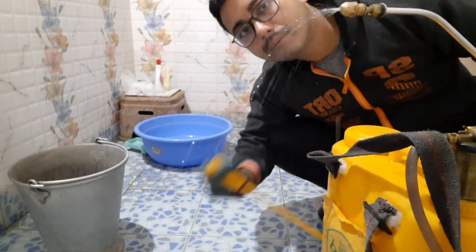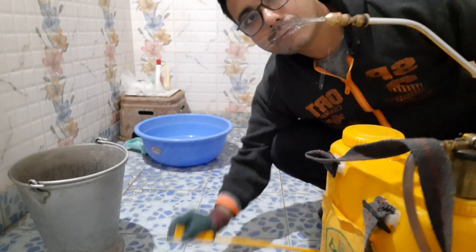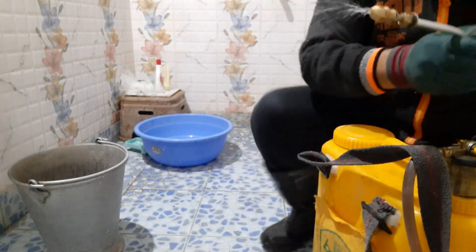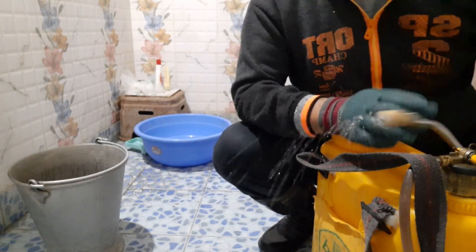We try one more time and we can still see the nozzle is not spraying smoothly — it's sprinkling but not spraying in a uniform, smooth way as it should. That means we still have impurities and sludge stuck to the head of the nozzle. So we open the nozzle head again and brush it. You can see the liquid or chemical is not dropping smoothly out of the pin holes.